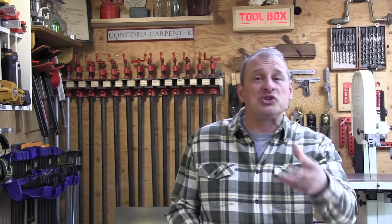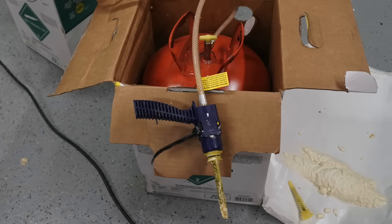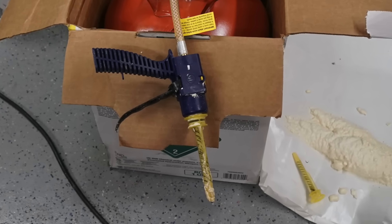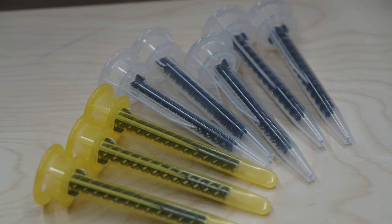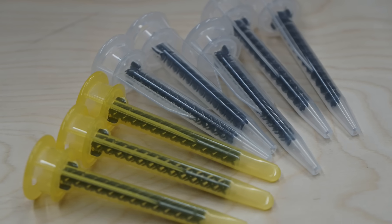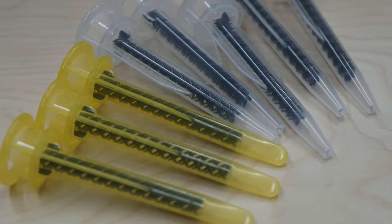When you stop applying the spray for any time more than 30 seconds, you need to replace the nozzle. To avoid this, exercise the nozzle every once in a while to prevent it from curing. There are two different types of nozzles that come with the kit: a yellow nozzle for wide spray patterns, best for walls, wall cavities, and rim joists; and a clear nozzle for much narrower spray patterns.